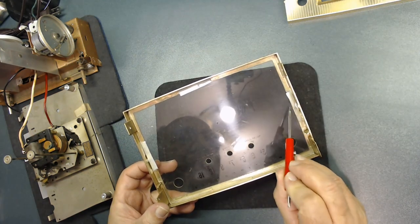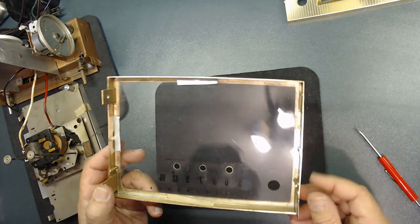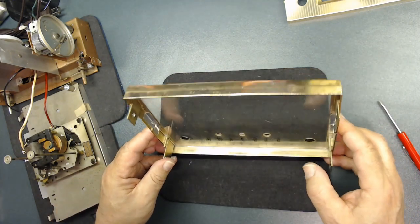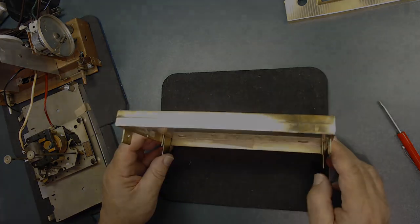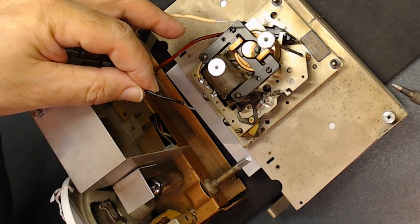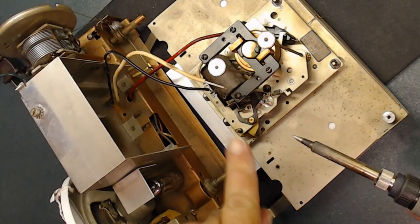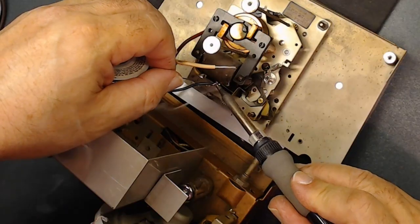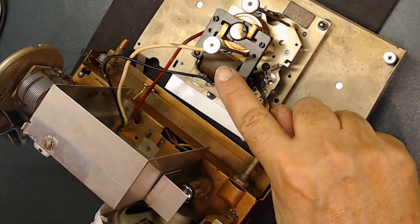Now I'm just bending the tape — it's pretty sticky. This goes in this way, all the way down. I'm going to lift this up. See, now it fits very well and it's not going to come out. All of them are installed. So let's reassemble everything back together — needs some cleaning before installing. Let's solder this back together. The black wire I'm going to install this way so it doesn't rub against that again — it was going the other way before. So I'll route it a different direction. Hopefully that will help. This is done.